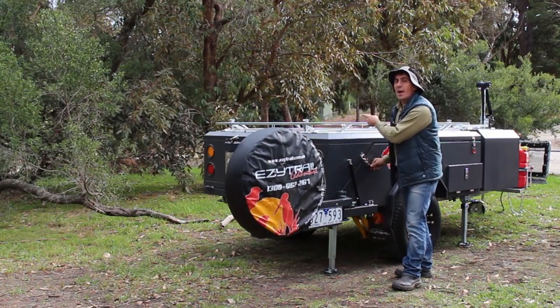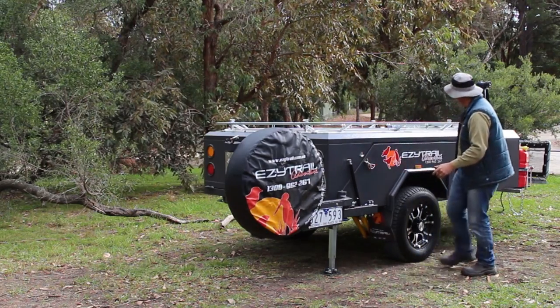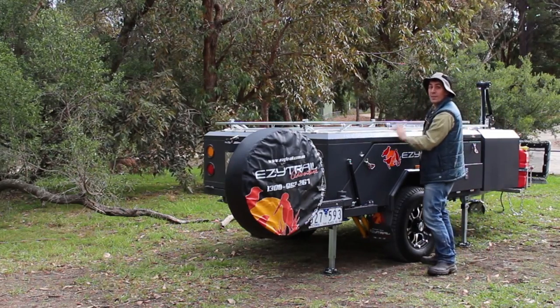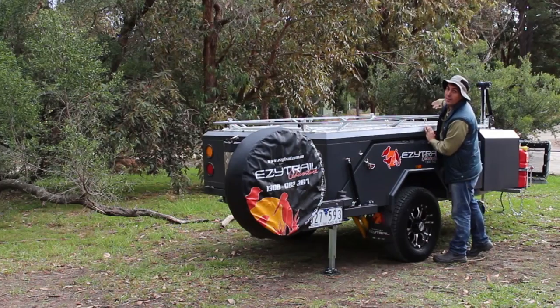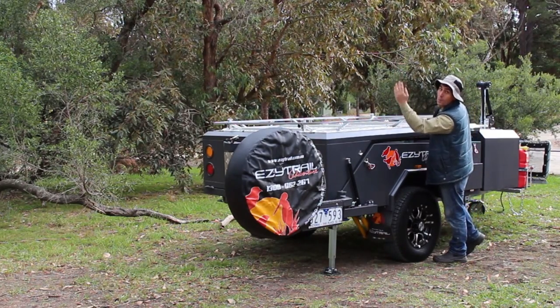Now, I'm going to swing around to these over center locks on the side. I've released the two on the other side, but now, with this one, release, and release. Now we're going to bring this up just past the vertical. This is the exciting part. Okay, so reminding you to always check that it's securely attached. That's the winch, of course, because it's going to pick up the weight after the vertical.